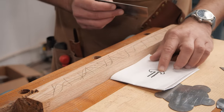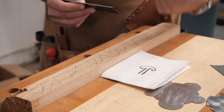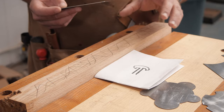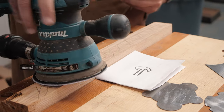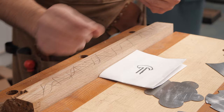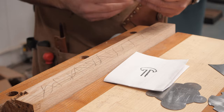Sometimes you get a little bit of dust, but you've created a microscopic hook on the end of your scraper. One of the places I really love card scrapers is small pieces — something that is thinner than your sander. What happens with a sander on thin pieces is you'll often round over the edges or get a hump in the middle because the pad is slightly padded, creating a slight concave effect.